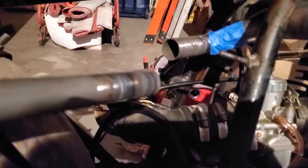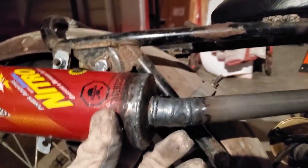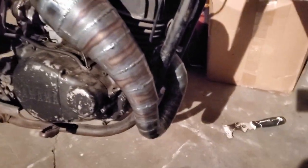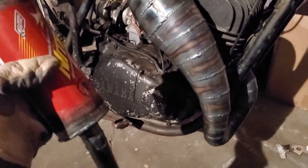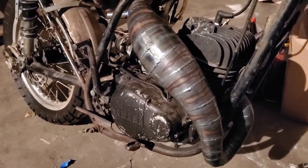In the next video we have a whole lot to do. We're going to attach a spring system to fasten this, finish up these welds, and make a rubber mount back here — this is a decent amount of weight hanging pretty far out and I don't think the springs alone will hold it steady. We'll also make a mount for the expansion chamber itself, make a gasket for the front so there are no air leaks, and lastly we will clear coat the entire thing to preserve this raw metal look. I don't want it covered in rust, and I don't want to paint it — I just like this raw welded metal look. Please stick with us, subscribe if you haven't already, and stay tuned for the next one. Thanks guys!